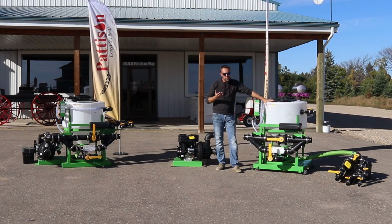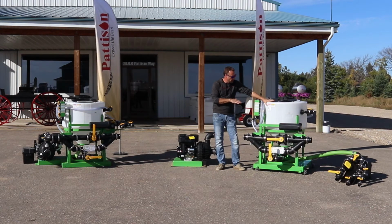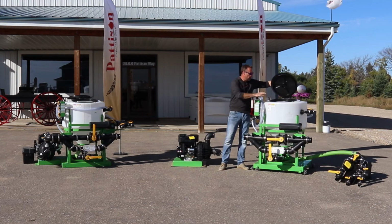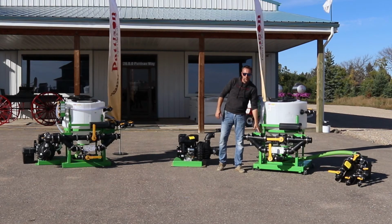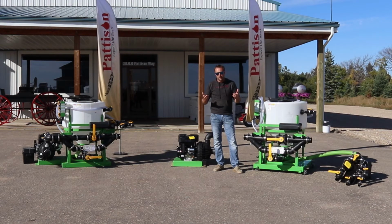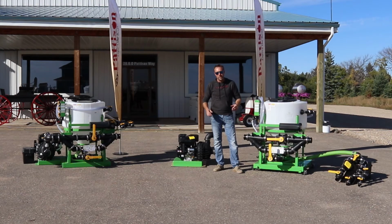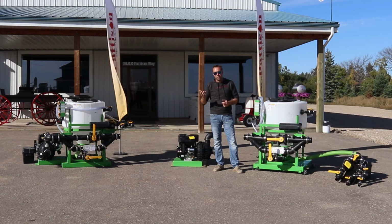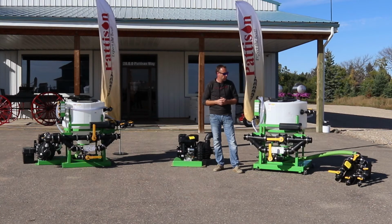that we're using now instead of the 30 gallon tank, again, it's nice and low to the ground. You can see you'll still be comfortable smashing jugs at this height, and these valves can be removed as well. So theoretically you could remove these valves and the pump and the meters, set it all on the deck, and never climb on the deck to fill your sprayer if you're just using totes.